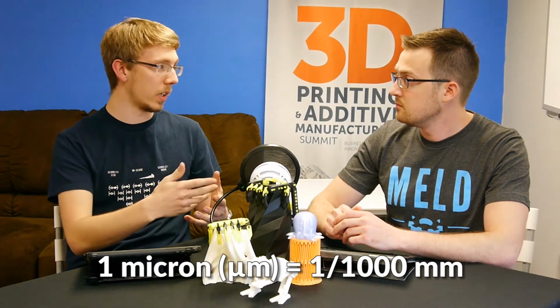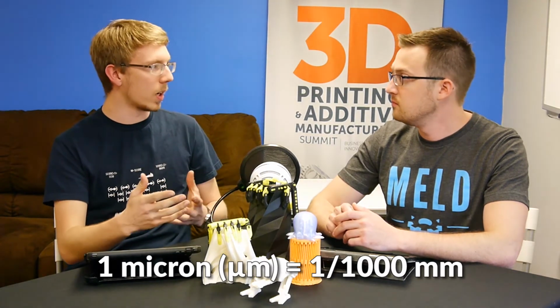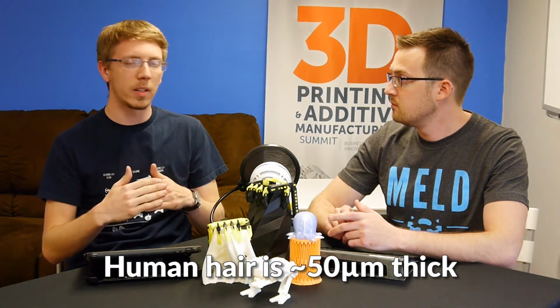the design itself, not even just the file quality, but just how complex of a design it is. Yeah, layer resolution, how often your layer height is. So in these, standard is 200 microns. So, in some people's opinion, like you said, that could be high quality. To us, that's pretty good. For the FDM, that's pretty high quality. You can go down to 70 or 75 microns on the Cube Pro Duo or on the Cube Pro line. You can go down to 100 microns on the MakerBots. Setting-wise, I think you can go a little bit lower if you go in there and change it. But yeah, I've heard of some people with an FDM printer going as low as 15 to 25 microns, but it's pretty finicky at that point.